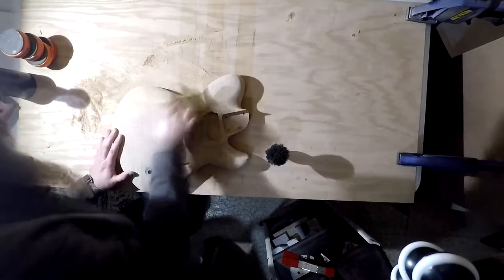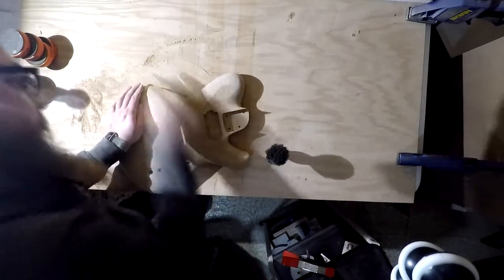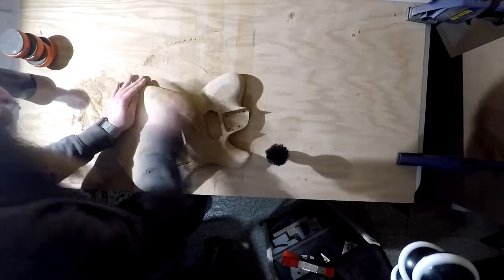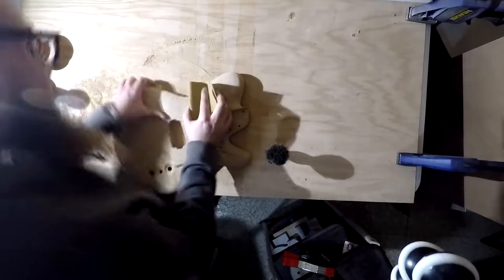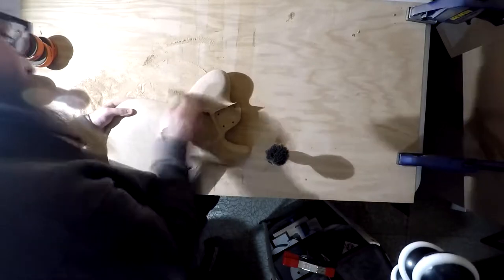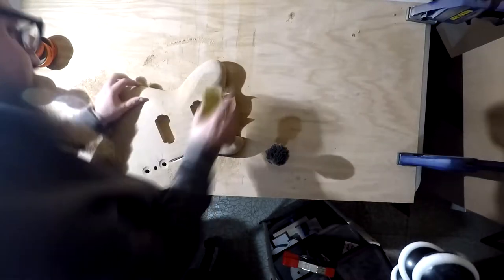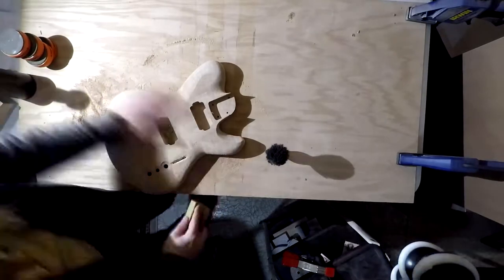Once you're done, we'll move on to sandpaper. This will take care of the rough surface. Start the rougher the better. I'm using 60 grit here. This is more for material removal to take care of any leftover chisel marks and deep scars left by the rasps. You want to move through the grits, starting fairly rough.